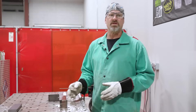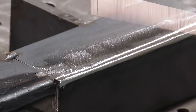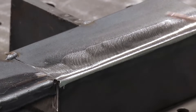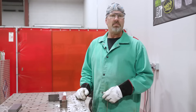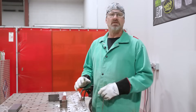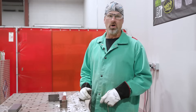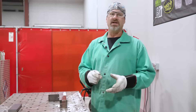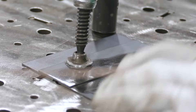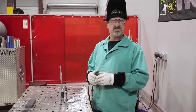The eyeball on the hood got fired. I had to weld this thing up and wasn't real happy with it. But just to go to show you — if you take your time, like I said earlier, if you got a boatload of patience you can achieve a very good quality looking weld. Even though if you have a bad fit up, take your time, let it cool between the tacks. You're going to have to grind it because it looks ugly, but a good fit up goes a long way. So the next joint is a lap joint — my favorite joint to weld because it's flat and it's easy.